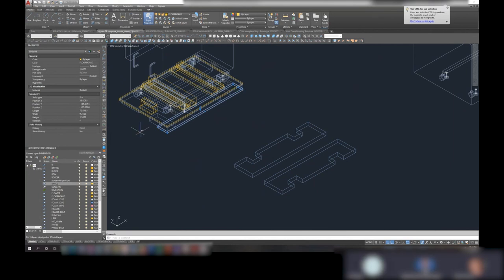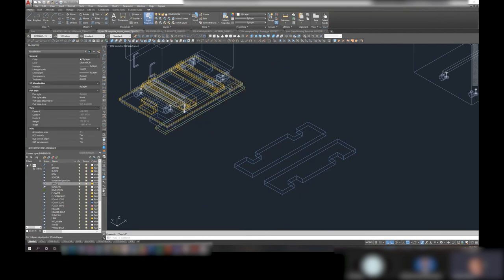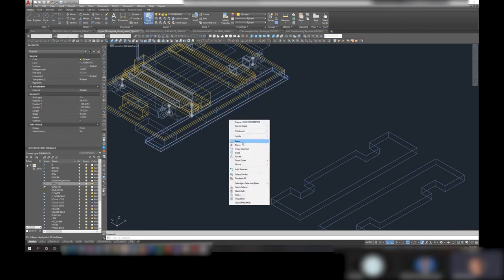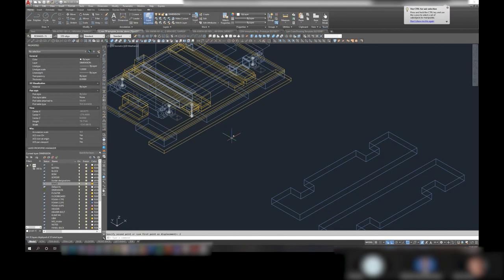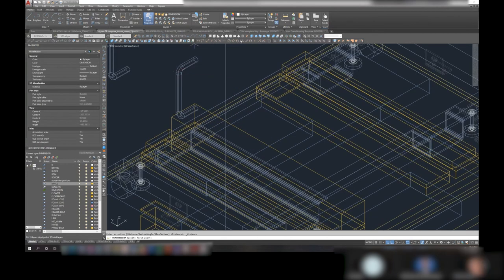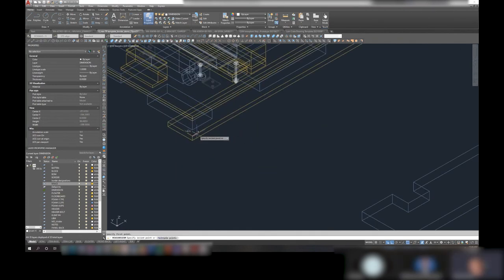This is the foam edge, so normally I will put in 2 inches, another 2 inches clearance, so it becomes 76 inches. You get me? 76 inches, 2 inches clearance, 2 inches clearance. Then this one also another 2 inches clearance, move out, and lay out my floorboard. So this edge must check with our machine edge.